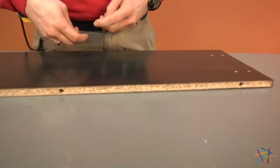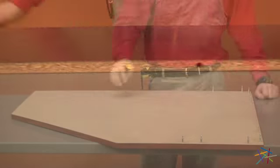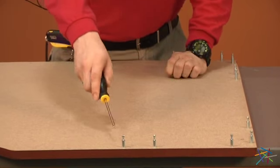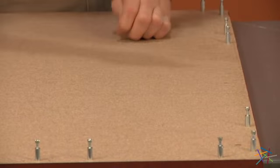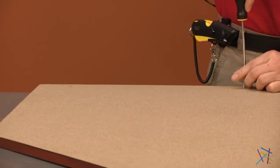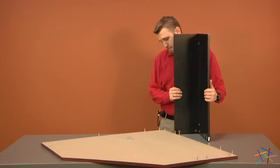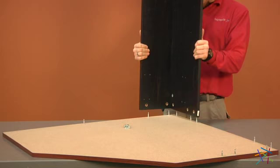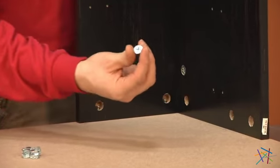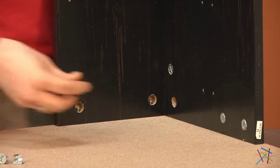On the unfinished side of panel O, take two of your dowel rods and insert one on each side. Now take your piece A and with the corner facing your left side, place three of your pins along the top, five on the side, and three on the side closest to you. Tighten into place using your phillips head screwdriver. In the corner, place your preassembled pieces M and N, then using five of your cam locks, insert in each hole and turn to the right to tighten.